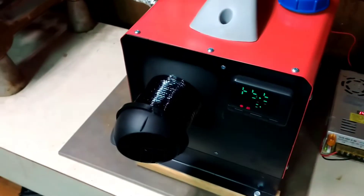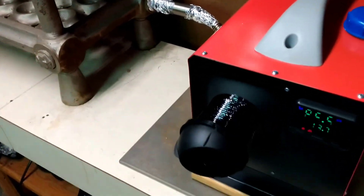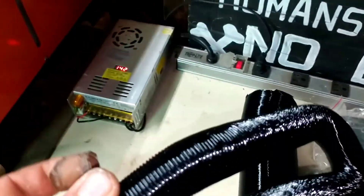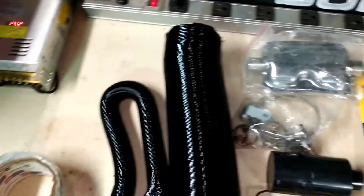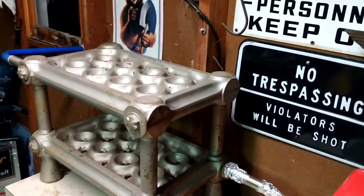If you like seeing the diesel heater and how to hook them up indoors — it's kind of a weird setup. Normally you would just duct that outside and make a little barrier gasket. Right now it's doing its cool-down cycle — see, it's blowing out heat. You don't want to just shut it off because it'll fry the electronics. I've got a fuel gauge here — you can see my level's about halfway up. They also include a little slot here for your screwdriver when tightening the hose clamp on your exhaust. Anyway, until next time, thanks for watching.